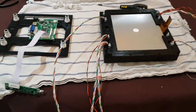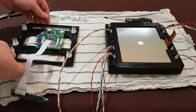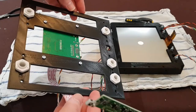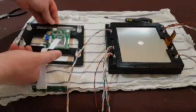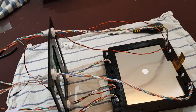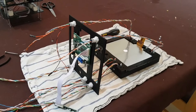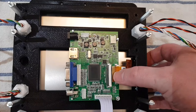Layer 4 holds a PCB that drives the LCD. It also has a number of cable glands which are there to hold the wiring so there's no chance that a sudden accidental tug on them could pull away the solder connections at the back of the tactile PCBs. I line everything up and start feeding through the wiring. On each of the M3 screws protruding through layer 3, I've put on 3 nuts so that layer 4 sits on top of the 3rd nut across all of them, suspending it at just the right height for the ribbon cable as it passes across — which also nicely aligns with the socket it clicks into on the PCB.